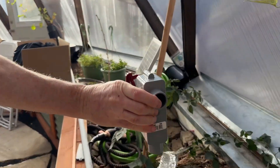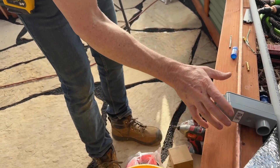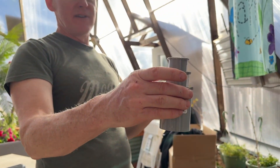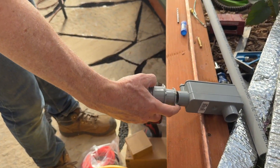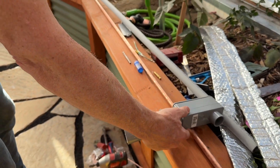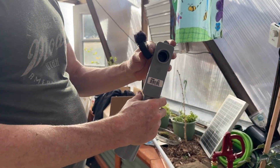This gets mounted on the top, and I got it without the U-bend so we can see the wire and help fish it through the rest of the way. We've got a bunch of adapters to push it down to three-quarter-inch, and then that goes on top like that. We'll just put a little piece of conduit in between, and then that way it makes a 90-degree turn and goes right over to the panel.